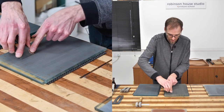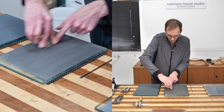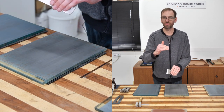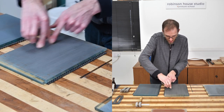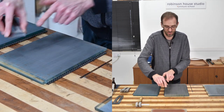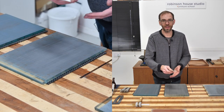This is my blade for my plane — it's about five millimeters thick, a nice thick blade. I go heel down like that, then push it down — index finger here, index finger here, heel down — and then just go backwards and forwards. It's resting on the two peaks there and there because this is a hollow ground blade. I do it at 35 degrees or thereabouts. I try not to pivot side to side; I lock in and bend my knee going backwards and forwards.